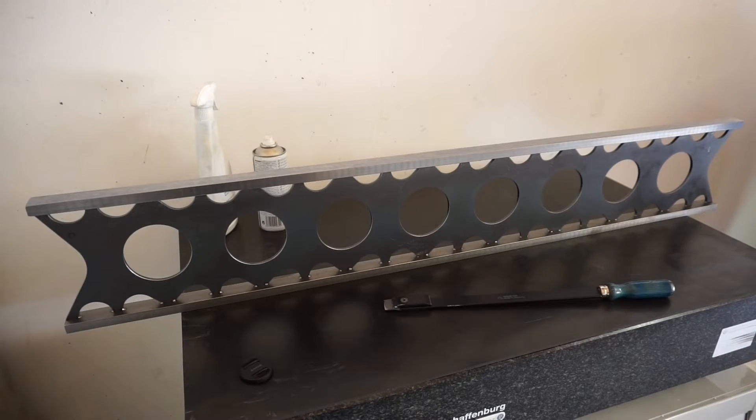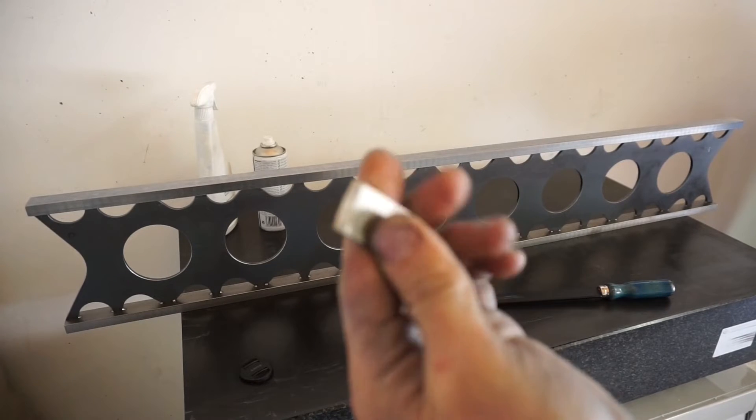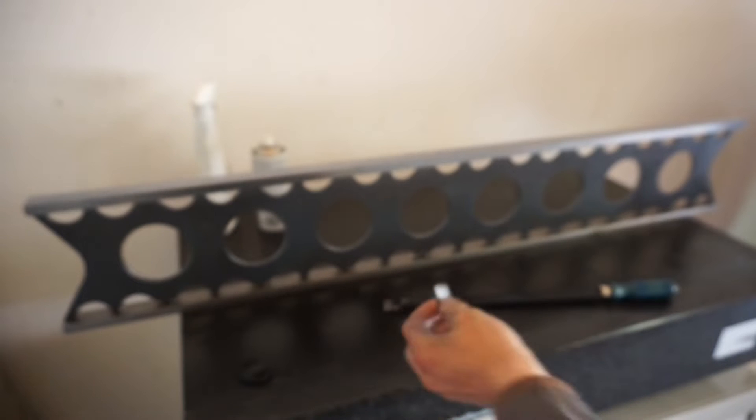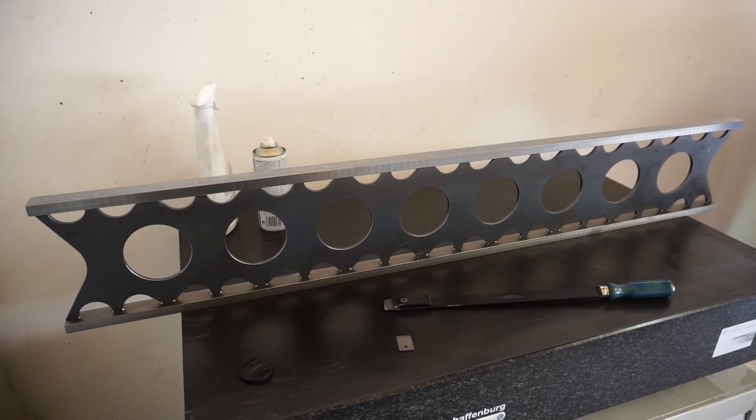This implies two bottlenecks which must be solved. The first is that carbon steel is a very stubborn material to scrape. However, this can be overcome to a certain degree by using a dedicated scraping insert geometry and a slightly altered scraping technique. I made a video about this which you can find on my YouTube channel. The other bottleneck is that the welding must be done in a very careful and thoughtful manner so as not to compromise the precision and long-term characteristics of the straight edge by welding-induced residual stresses.